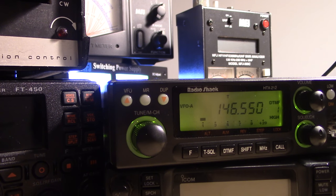Real-time test: running about 4 watts, blinking on the last segment at plus 20. Eric switched to the IC-736R satellite rig with variable power control — going down to half a watt. At half a watt, John reports it's S7. Eric asks Dave: at half a watt, Dave reports 60 over, full scale. The metal mast definitely did a number — SWR now is about 1.2 to 1.3.